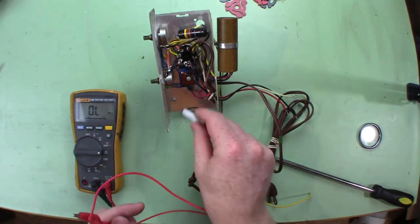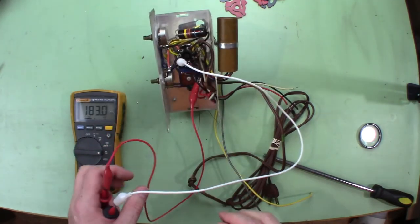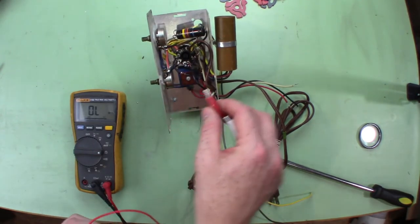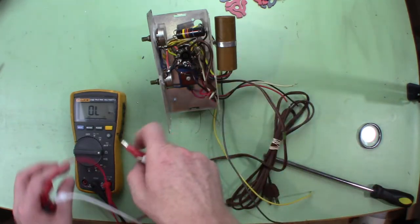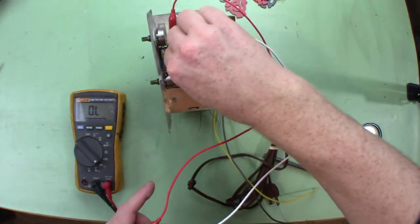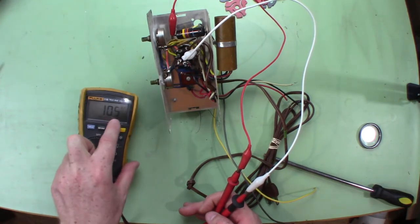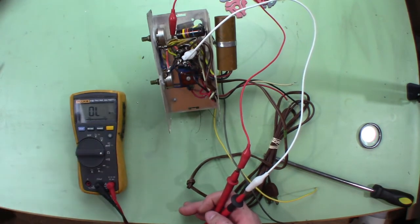On the primary of the transformer — the blue wire and the red wire — I got 183 ohms, so that's probably good. We can't measure the selenium diode. That capacitor should be 47 nanofarads and it's reading well up in the hundreds, so it's definitely not ideal. At least it's not shorted, though, so we'll go with that for now.